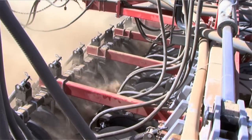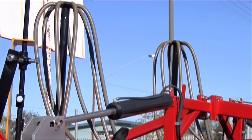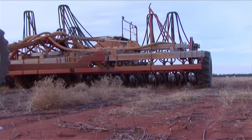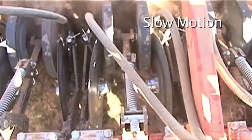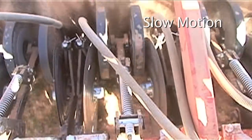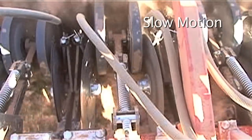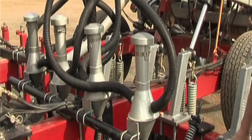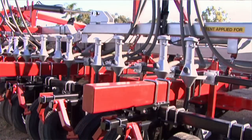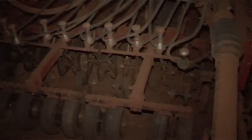We also manufacture air kits to suit all machines — all air seeders and all cultivator bars. When we fit them we've got our own particular setup. They're available in kit form and can be retrofitted. It is advisable to get the air kit when purchasing the machine from us because we fit them free. Diffusers are not normally required, particularly when we fit the air kit, but they can be useful if you've got a backpacker or are operating the machine at night and you want to blow the air out strongly to avoid blockages, then dissipate the air before it hits the ground — otherwise you'll get seed blast. If ordered with the machine, we fit them before it goes out; if not, they're retrofittable and available in kit form.